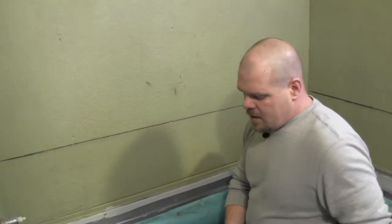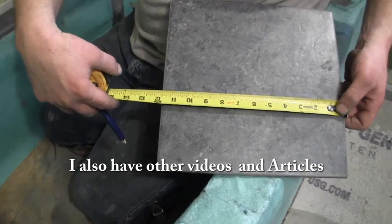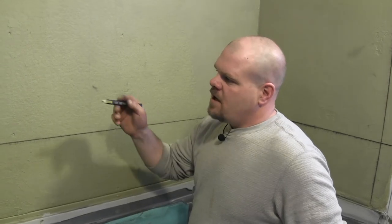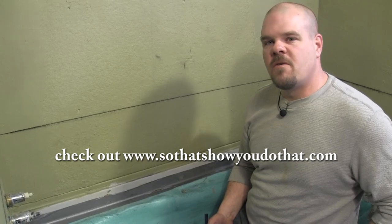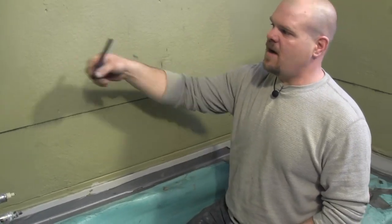The tile is 11 and three quarters, so that would mean cutting a quarter inch off. It's a little hard to cut a quarter inch — you can use a wet saw, but even that can be difficult. We need to decide: a bigger tile or a smaller one? The smaller pieces are still close to a half a tile, so it doesn't look bad. Plus, you have a smaller piece on both sides, so they'll match. I'm going to stick with this measurement.